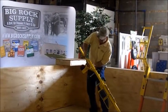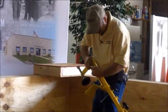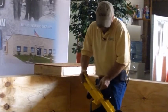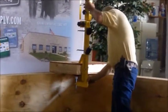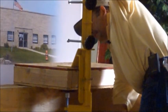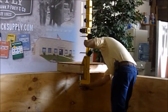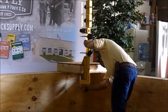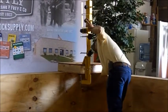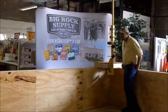If you're going to use it in a slab grabbing or deck grabbing situation, you move the clamp to the bottom, secure the locking pin in the hole, then set the post on your deck, secure the clamp, and at that you've got the post mounted. Your next step would be to measure for your rail heights.